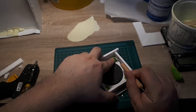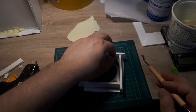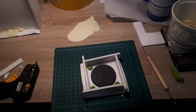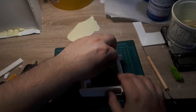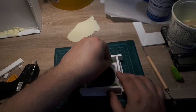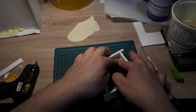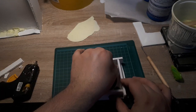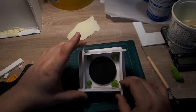The broadside base I would consider to be a medium-sized base. It's still pretty much possible to recast it using the two-part mold method. However, a base for something like a Storm Surge or Dune Crawler or any larger models are actually way too big to recast with just the regular wobbly silicone halves. The base is simply too large to use silicone alone. That is actually where some sort of reinforcement would be perfect, to make sure that your bases don't come out warped or the walls end up too thin.